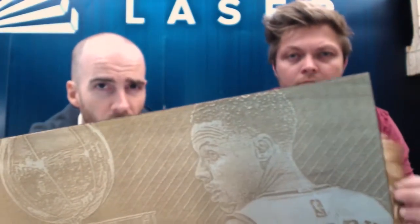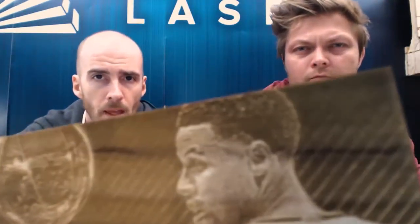Looks like Steve Hasbrook has one more question coming from Facebook. On the lenses, I get the focal length and shape, but why is the quality of the raster better on the 1.5? Is the beam smaller? That's exactly right, Steve. The spot size of the beam is smaller. So you're basically carving with a smaller knife as you do the engraving. I think it's most evident in the hair on Mr. Steph Curry there. It can get washed and blown out. And then with the stain settings, you actually get a lot of fidelity and detail.